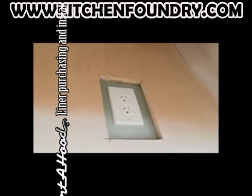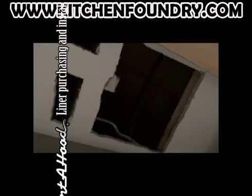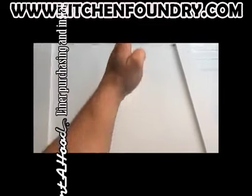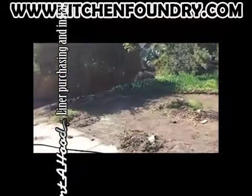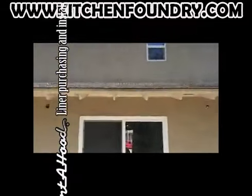So we'd rather see from the attic space some Romex that's coming down from this attic line down into the top of the hood and secured with a strain relief, so the electrical connection is happening inside the hood. For this duct run, I'm going to be using 2 45-degree turns that I'm going to make out of my adjustable elbows. And as we go outside here, you're going to see it's going up into a ceiling line, and I'm going to have the roofing guys cut a hole up there for my roof cap.